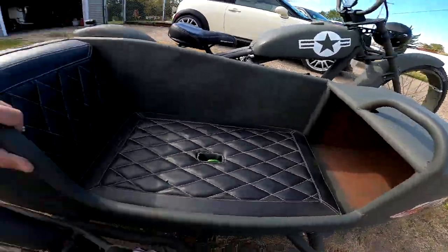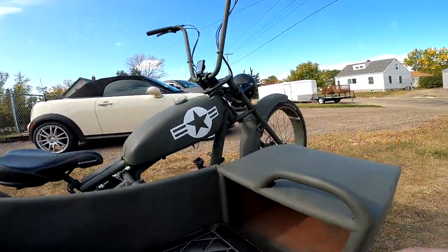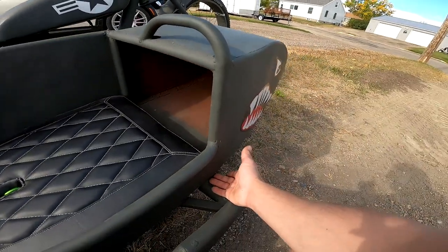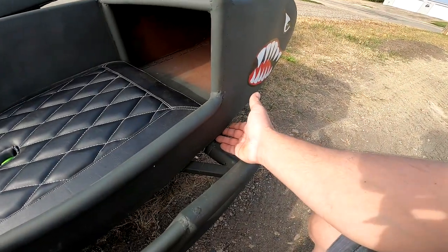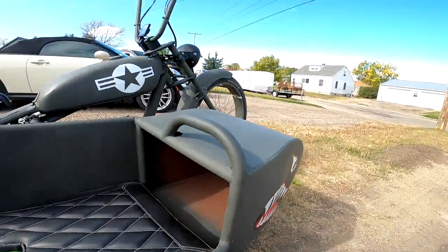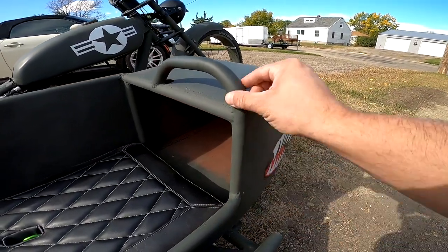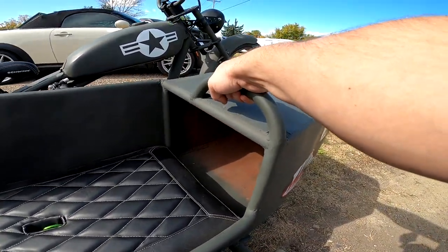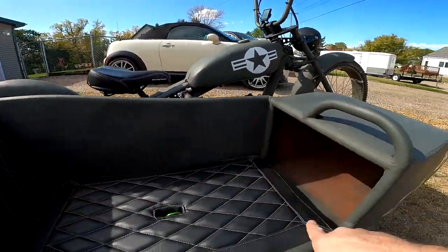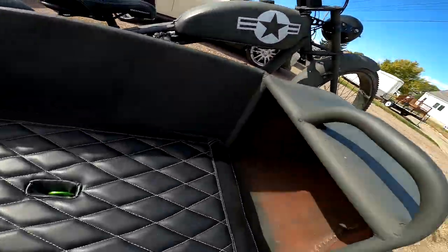So the tube frame for this, if you look, the sides are nice and rounded, right? What I did is I originally built it with four tube corners to go up from right where they bolt. There's nuts welded in the end of those pieces of tube, so that tube is bolted straight down there. And then I squared it off. This is that tube. Welded atop a handle on it, a grab handle for a passenger. Tied it together over here and over there. And then once I had that, that was pretty much the opening and the frame for it. So then I used an old